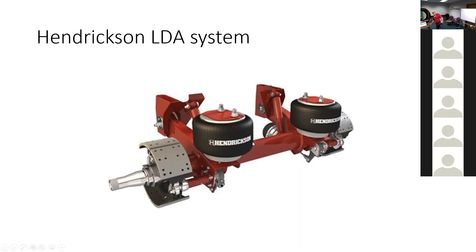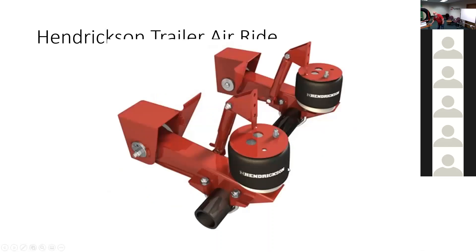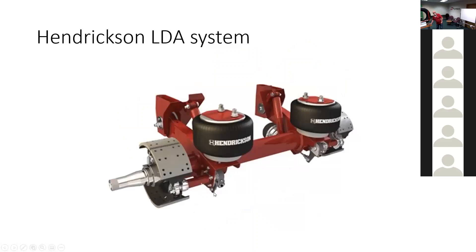As you hit bumps in the road, that axle flexes and it chops the inside edge off the tires. The simple way to identify this is that the axle is actually welded into the suspension. Here's the standard one — you'll notice how much wider the trailing arm is, how much wider apart these brackets are, smaller diameter axle with a thicker wall — and it's held in place with U-bolts. If you use U-bolts on this thin axle, it crimps the axle, so they had to weld it because they couldn't U-bolt it.